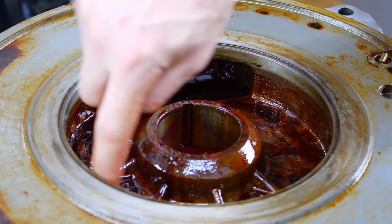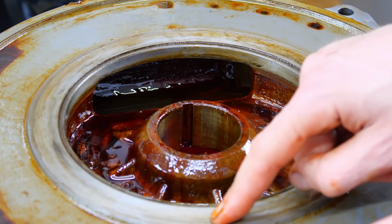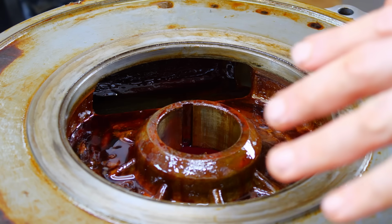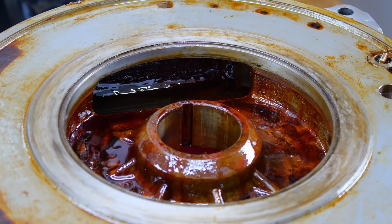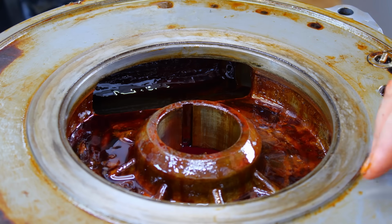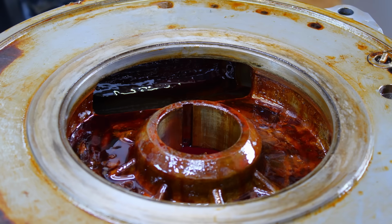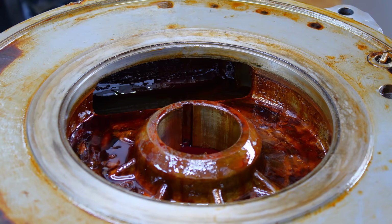And over here, this is the large diameter that the platter is rotationally guided on. And we have two ring surfaces that form the axial bearing of the faceplate. Over here you can see the indexing pin. I think this can be driven out from this side. I have to look into the drawings again. The drawings for this are not great. There are two cross sections and they are very small and not the greatest of a print. Which in all honesty, all of the Deckel drawings are not that great, at least the drawings that are supplied for the customer to work on the machines.